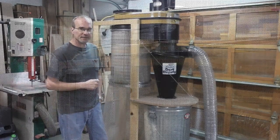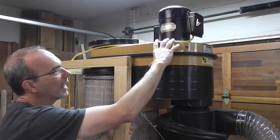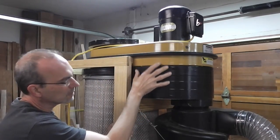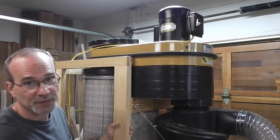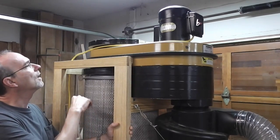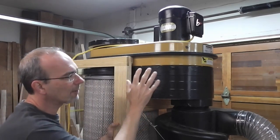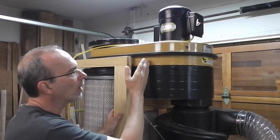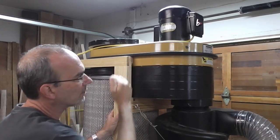Let me show you some of the details of this. Here's what happened to the old dust collector. Originally, there was the housing here which houses the impeller and where the bag attaches. There was a large plastic piece underneath where the hose attached. I eliminated all that and trashed most of it. What I'm left with is the motor, the housing, and the impeller. I had to create this custom baffle because I had to move the dust deputy out from where the hole was for the intake for the impeller that goes into the rest of the system.